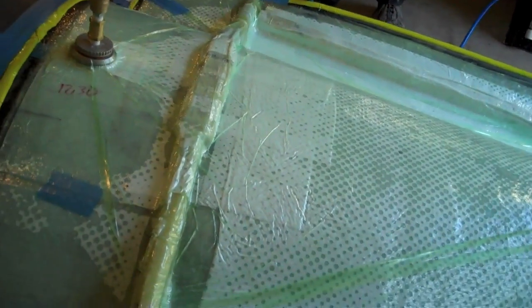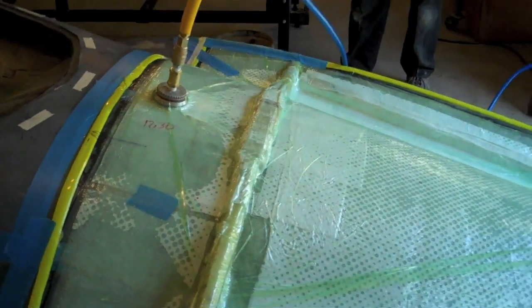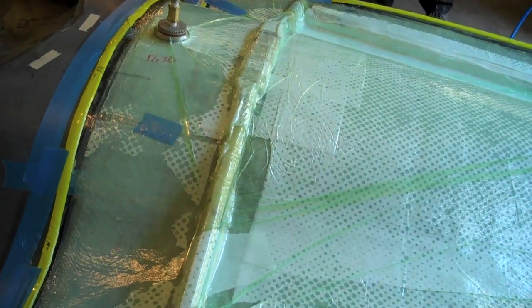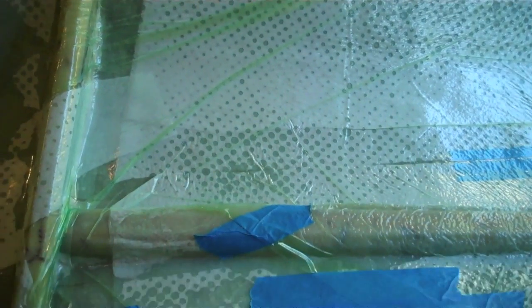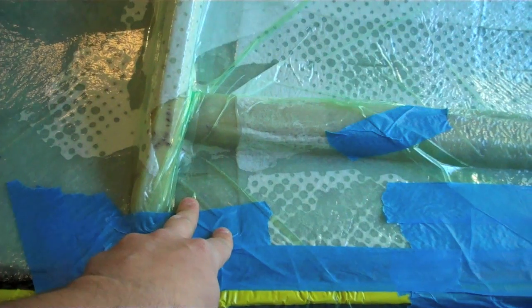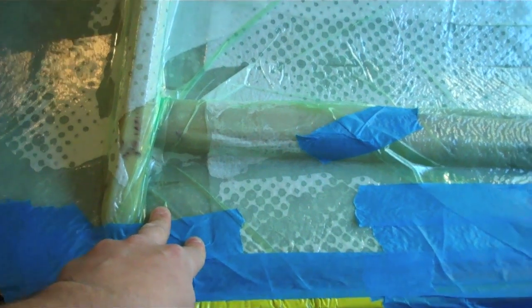The shredded wheat edges fold together really well and go around the curved shapes. Put a couple layers of that on, and then a final two layers, and then we came back along the edges with some S-glass so we have a nice edge when it's done. And then we put our bagging material over it, and fought with the plastic a little bit because we were running out of time, and we got it to shape the way we needed to. Put the pump on it, and by tomorrow morning we should have a mold for the trunk.